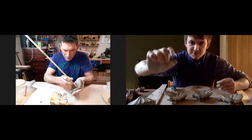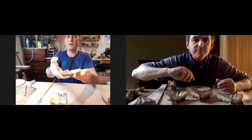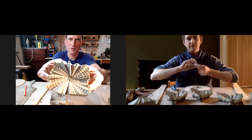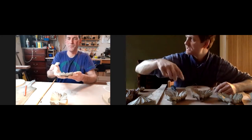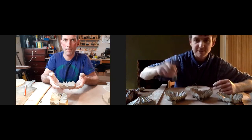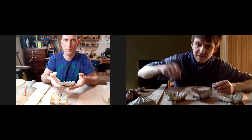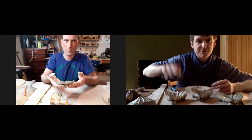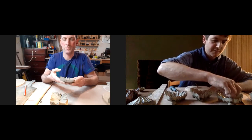And squish it in. What I found... That gives you that. If you use bamboo, you get an extra little circle thing in the middle. It's quite cool. What I found with these deeper ones is when you do this, you're doing two things for the price of one. You're sealing that hole, but in compressing it, you're also flattening the base on the underside against the wood, which is quite good. So you're doing two things in one go, which is quite a good thing.